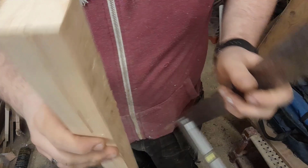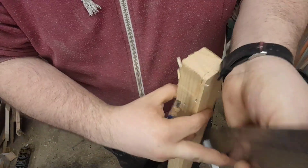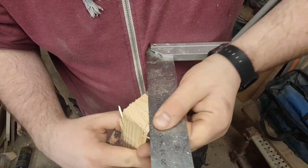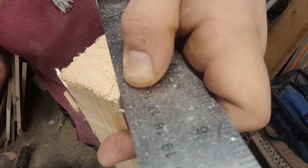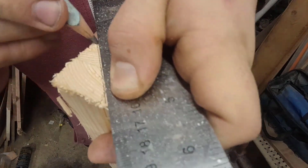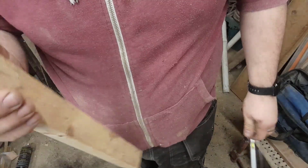So to turn on the lathe, we need to find a center point. The easiest way to find a center point on a regular object like a square or rectangle is by diagonals. So let us bring you down to the top. You can see here, top of our timber. And all we're going to do is get a ruler and go from point to point on the corner. So I'm just guesstimating because this corner is a bit wrong. Just like that. Just like that. And that then is your center point. And you need a center point for a lathe, because lathes work up the center.